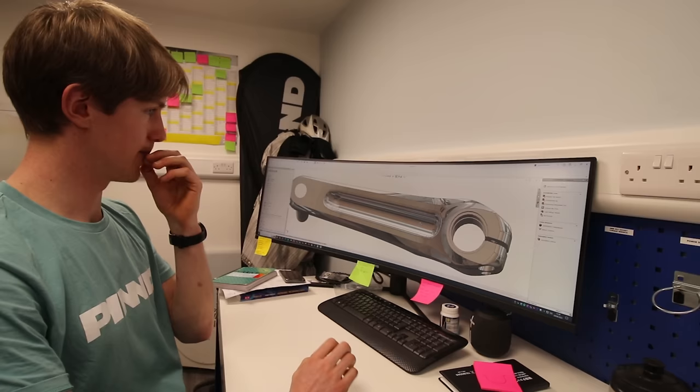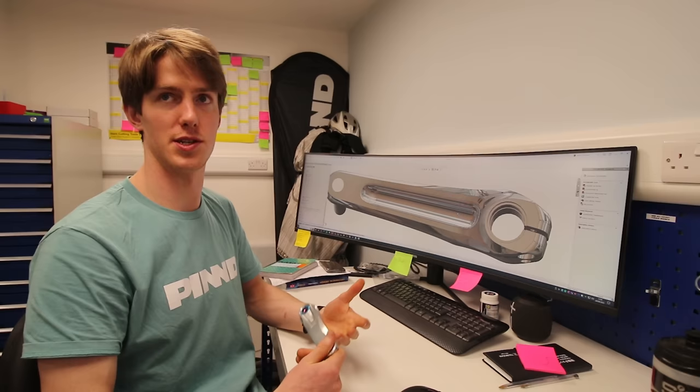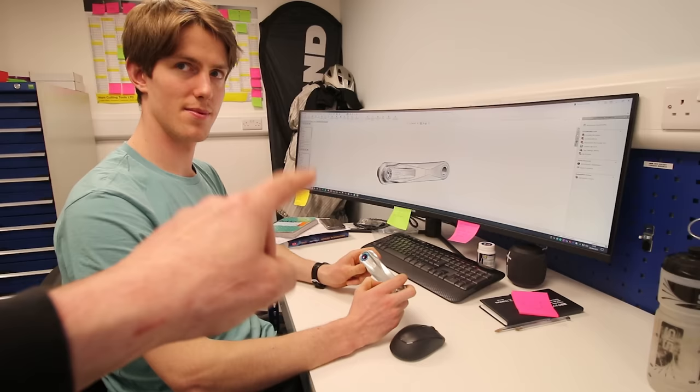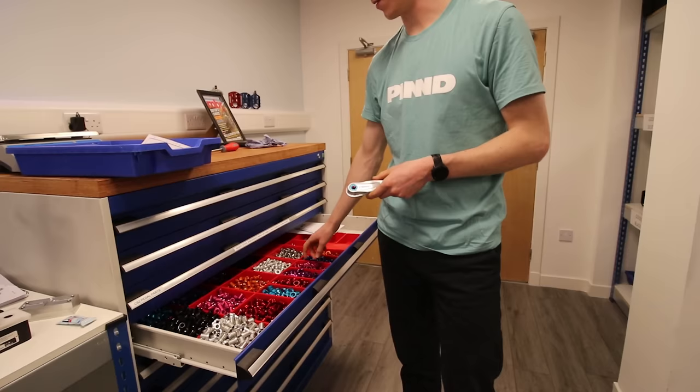Because you're doing short cranks, what length have you been testing? As I suggested, 145mm is going to be much more stable than 165mm — just less of a lever. So all the cranks are tested at the longest length we stock them in to make sure they're strong enough. Color-wise, a nicely subtle approach — the cranks come in silver and black, and then you can mix and match the captive nut and crank bolt colors.